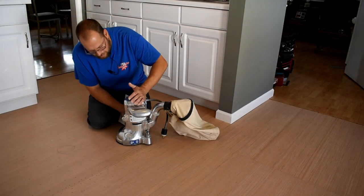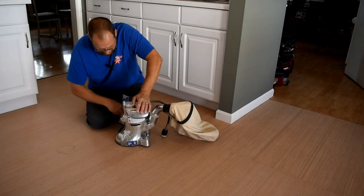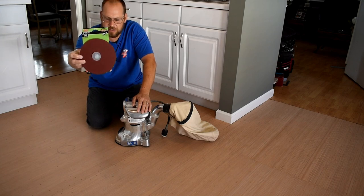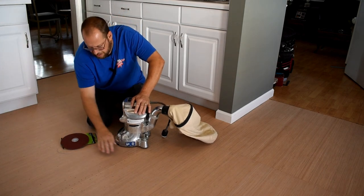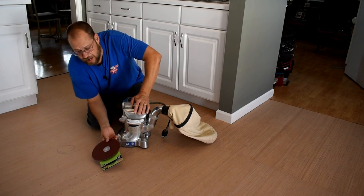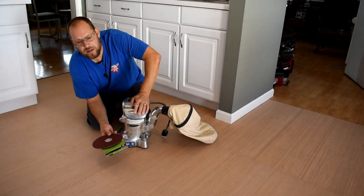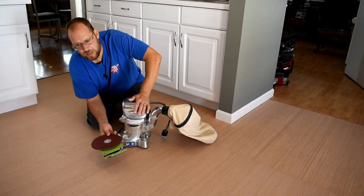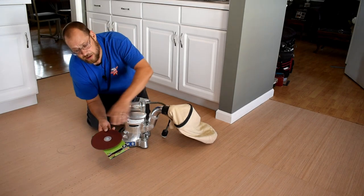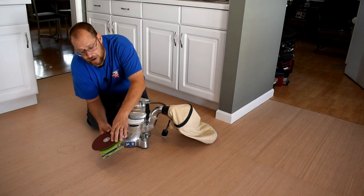In this video I am going to be using my Clark American sander floor edger. I'm going to use a 50 grit sanding disc to run over these seams right here. I choose to use a 50 grit on underlayment just because they're not so rough and they're not going to dig a groove in the floor really fast before I have a chance to move it. This gives you a little bit slower working time so you don't have to be so careful about cutting a groove in it.